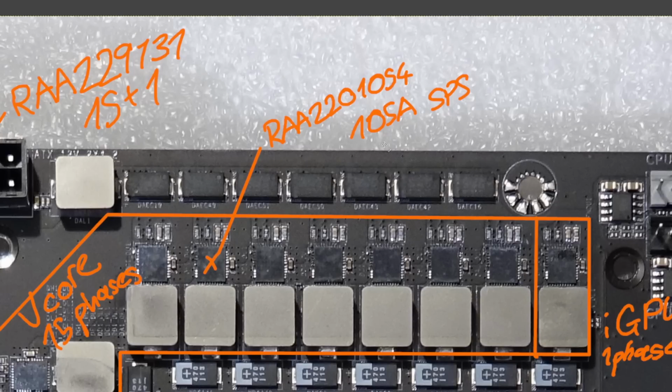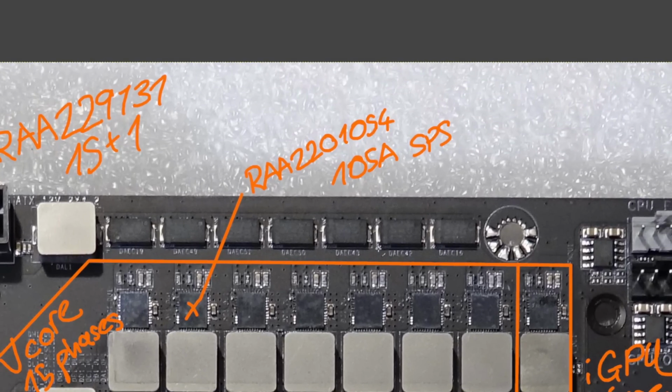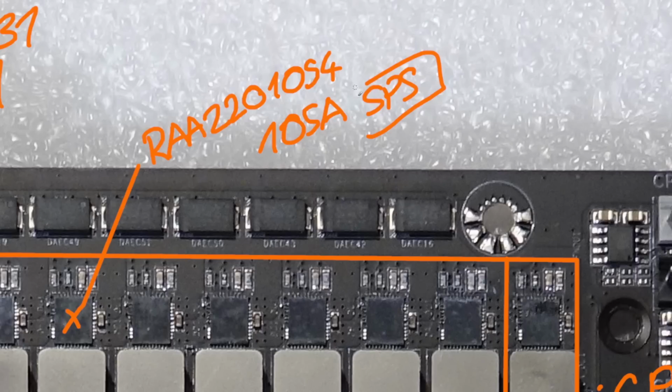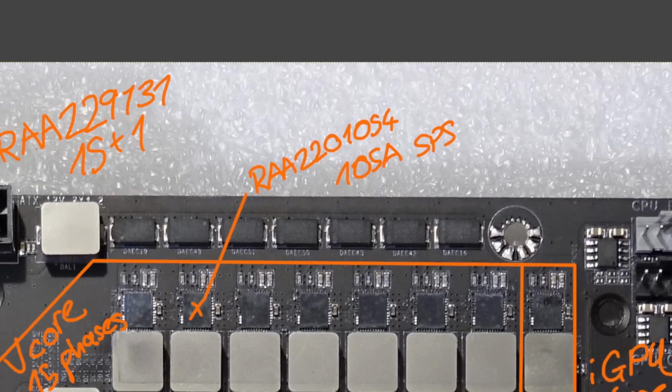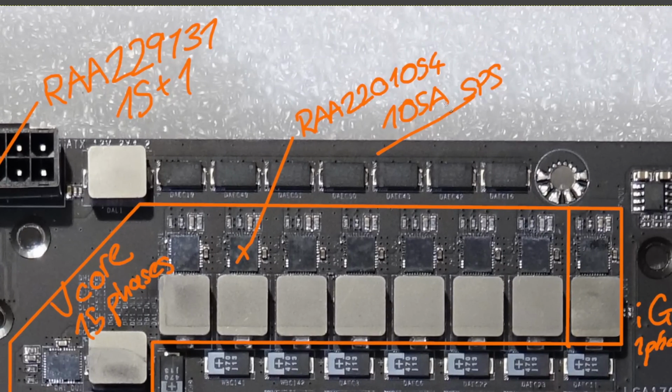We're not going to get into the others because there's too many of them, and some of them aren't self-explanatory from the name, so I don't like talking about them because I feel obligated to explain what they actually do, since the name is kind of misleading if you don't know what it actually means. But anyway, these are smart power stages, which is basically as good as it gets for power stages these days. 105 amp nominal current rating. These are very efficient, but you wouldn't actually want to run 105 amps through these, and Renesas won't even tell you how much heat they're going to produce above 60 amps output anyway, because if you're pushing more than 60 amps through a single power stage, you've done something wrong. It's just a bad idea.